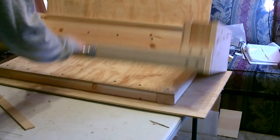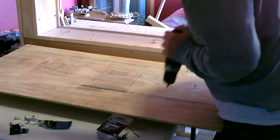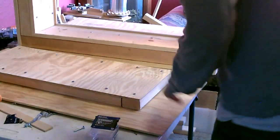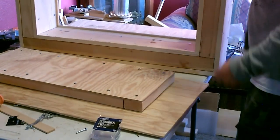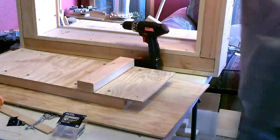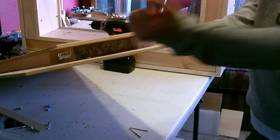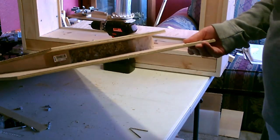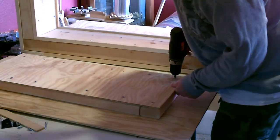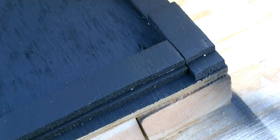Definitely go with the handle if you can - it makes it super easy to use. Then I'll connect the baseboard to this. To get the insulation in, I'm just going to remove this and this and take out this 2x3 temporarily - that should slide right out. Now just jam the insulation right there and then drop the 2x3 back on. I just stuffed it in there - took a long 2x3, jammed it, filled it, jammed and filled - just keep doing it until you can't get any more in. Then weather stripping around the edge, up the side, and I doubled it on the front.